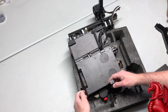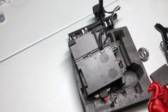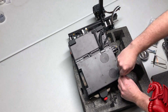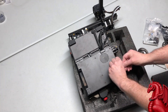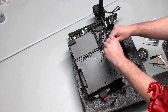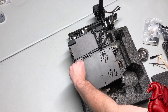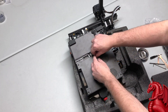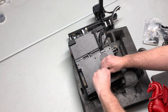Creality has a very bad habit of tinning the ends of the wires for the power cables, and that can actually cause them to come loose. You shouldn't put solder on the ends of wires — solder is never really totally solid, it will flow under pressure and can loosen the connection. It's a good idea to go under here, pull the two rubber feet off, take out all the screws, and use the included screwdriver to tighten up the screws on the attachment points.